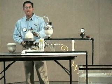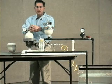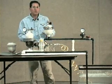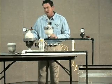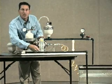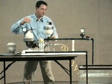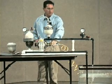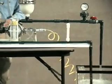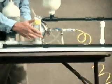To demonstrate the inlet stabilizer, I'm going to overcharge it, removing it from the system. Now, as I turn the pump on, you'll be able to see the pressure wave going back down the piping system, and the pipe will be shaking. And that's the pressure shock created when the ball valves close. So again, as those ball valves close, it sends a shock wave down the inlet piping.